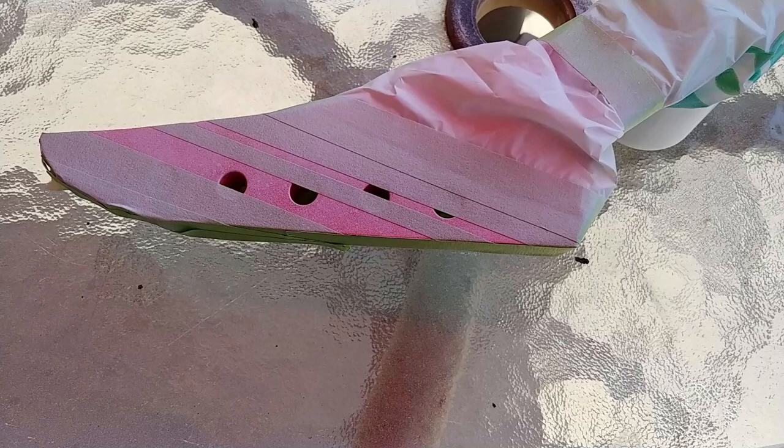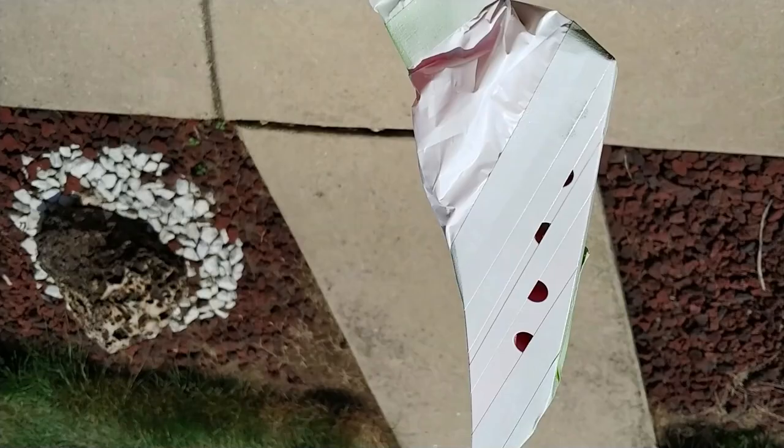Some people in interviews said how hard it is to mask something and not have paint bleed underneath the tape. Well, doing it the way I showed in my videos would help that person out as far as knowing, understanding, and learning how to do it. Use light coats — don't flood the paint up against the tape lines and you should be okay with no bleed through. Light coats until you get the depth or color you're looking for; in this case it was white.